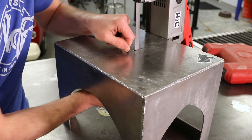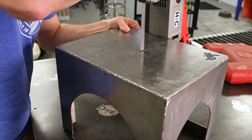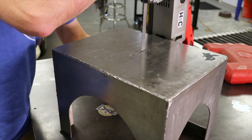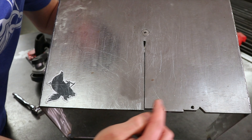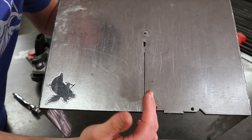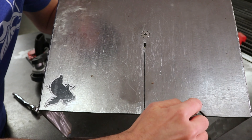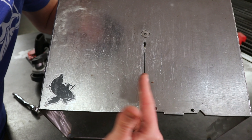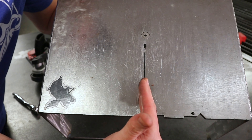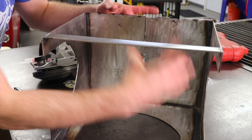Like I said, there's only this one bolt that actually holds the saw in. We don't even need to get it all the way loose to get the saw out — just rock it right out of its spot. I want to again point out these two set screws because they're a very important part of this build. They're what allows us to get the blade 90 degrees to the deck. When locked down, they push down on the saw, allowing it to rock and pivot so you can get squared up.